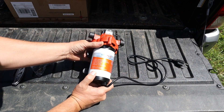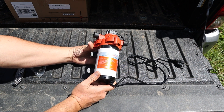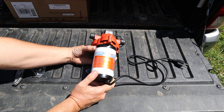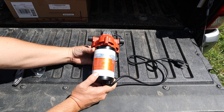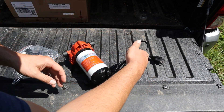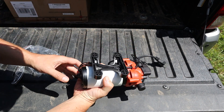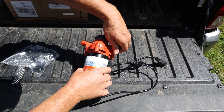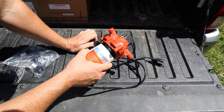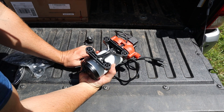The open flow is 12.4 liters per minute or 3.3 gallons per minute. Voltage is 115 volt AC, amps is 1 amp max, and the pressure is 45 PSI which is 3.1 bar. The power cord is on this side, about three feet long. Up top you have two wires going in for power, and it has inlet and outlet ports — those are half inch NPT thread. It also has rubberized feet to help with vibration when mounted.